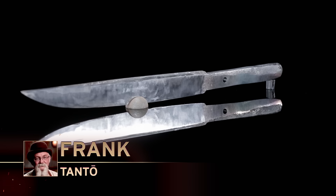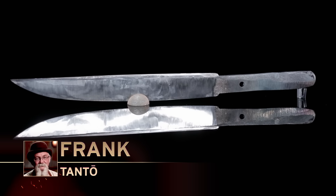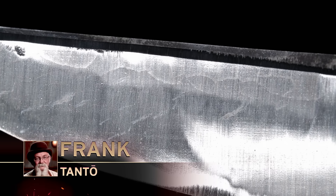I noticed that you would leave it in the forge for very extended amounts of time, which I was concerned about. That's detrimental to your steel at a certain point — I don't know what that metal's gonna be like; it may have some serious decarburization. Frank, you're up — please present your blade to the judges. As far as the shape goes, I think it's nice — you pulled the tanto tip off well. I like how you made your hammer in the dog's head style and got right into forging. But when I closely inspect this blade, I see things that trouble me. It's a lot of cracks — it's like a lightning storm going across the blade. Did you notice those? No, sir, I did not. That is one of my biggest concerns, and it's very unfortunate because that is where a blade can fail.